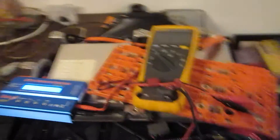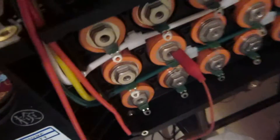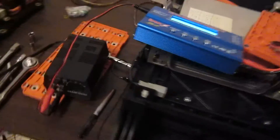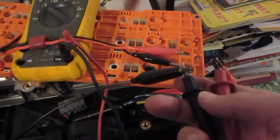One thing to be careful of is that the batteries alternate plus, minus, plus, minus. The red lead is hooked up to the square terminal — that's a plus — and the black one is hooked up to the hexagonal one — that's a minus — and that's the low battery. We're reading 7.2, so let's try hooking these leads up to the charger. Make sure to get the polarity right, and then we'll see if we can charge this up.